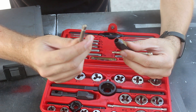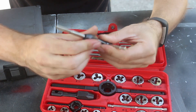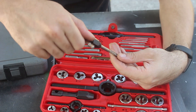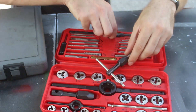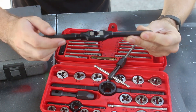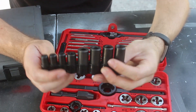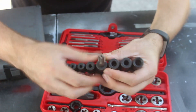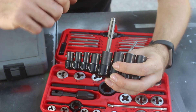The drive end of a tap is square, so you need a tap wrench, which holds the tap and lets you screw it into what you're tapping. Sometimes the big handle can get in the way, especially with a larger tap handle that you need for bigger taps. So another option is a set of tap sockets, designed specifically to hold a tap so you can use your regular ratchet, get into tight spaces, and get the ratcheting motion too.